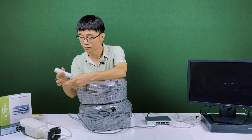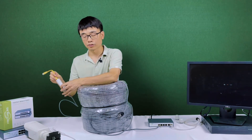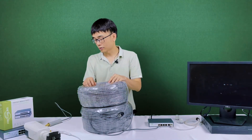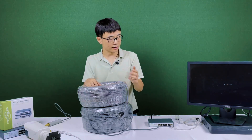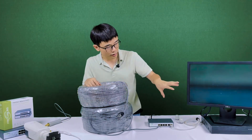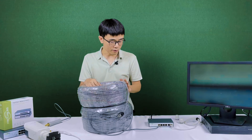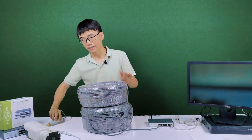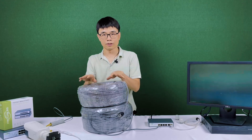I'm going to connect the cable to the input port of the adapter, then use a short patch cord to link the output port to the camera. Once connected to the camera, I can hear the motor running — this is a motorized zoom camera — so it will take a while before we see live video on the TV. You can see the beautiful thing about this setup: there's nothing else but just the cable between the PoE switch and the adapter, so if you want to bury everything, you can bury the cable directly — it's the safe way to bury the cable.